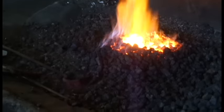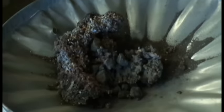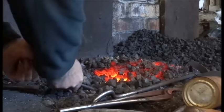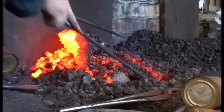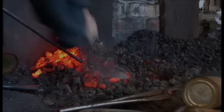When you are burning coke, the fire burns so hot that it doesn't really produce a lot of ash. What it does produce is a lot of clinker, more so than coal as coke is more concentrated. Clinker is actually glass and is a result of the silica content of the coke melting and agglutinating at the bottom of the fire. This needs to be cleaned out periodically to prevent it from clogging the tuyere iron, getting on your work, or raising the oxidising layer of the fire, which we'll talk about in a minute.